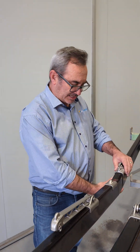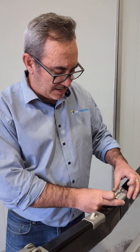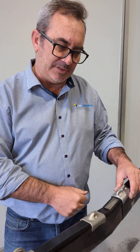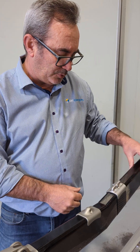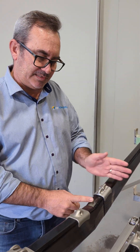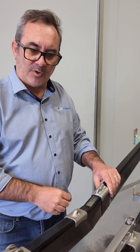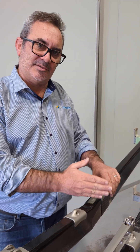We've got a new adjustable mainsheet hanger which we've made some improvements on. We've increased the clamping force so there's no ability for it to slide, and we've got about 300mm of movement so you can adjust to get your mainsheet hanger right. This is adjustable to suit if you ever move on or get a different deck sweeper.